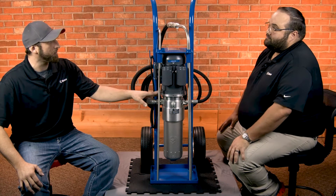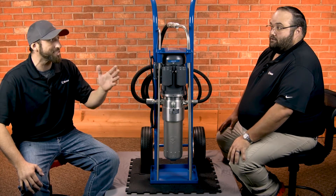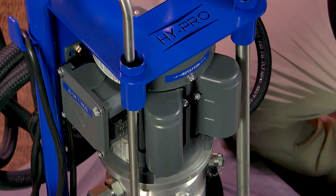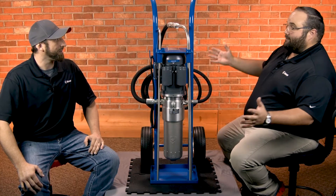They built this pump so that it can pump up to 2,200 centistokes — so a 460 fluid at room temperature. We know those can get very, very thick. So not only plastic injection molding machines, let's think about gearboxes, small hydraulic reservoirs. When it can go up to a 460 at room temperature, that really opens up a range where we can use it in a lot of different applications.